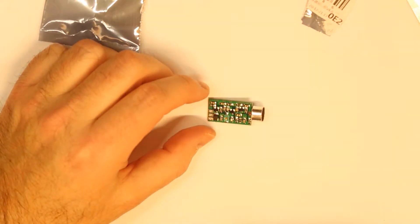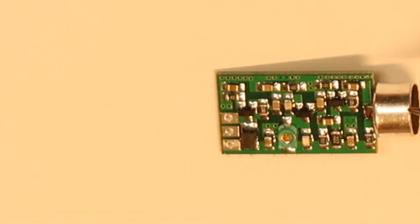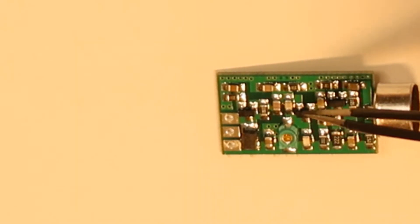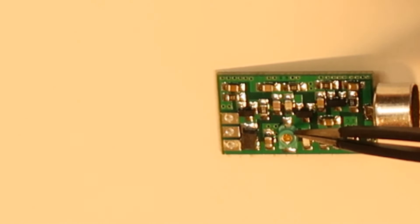If you've seen my previous video on designing a long-distance FM transmitter, let's talk about the components. Of course, this is the microphone — the input. Then you go to several components; each of the black ones is probably a transistor or MOSFET. I suspect these are regular NPN transistors like the 2N2222 or 2N3904, or something similar. The first stage is the amplification of the microphone, and then you have another stage which is the oscillator — this is the FM oscillation of the main frequency.